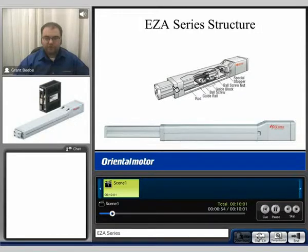The cylinder actually protrudes out the end of the actuator. Because the EZ-A series has a linear guide, it can handle a certain amount of moment load — and this is not the case with the EZ cylinder series, which is rated for no moment load.